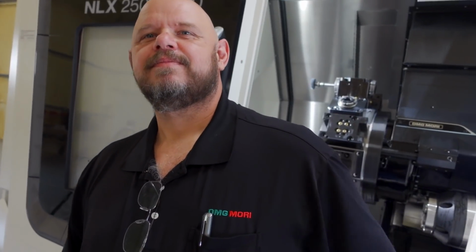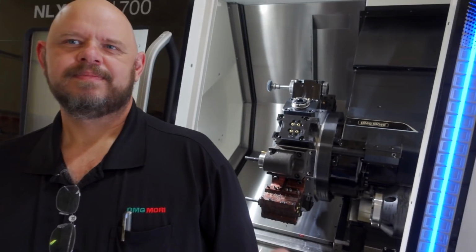So you were telling me that you run like this. What is this axis wise? How many axes? What is this considered? So this particular machine is what we call a 4-axis lathe. It's got X, Y, and Z plus the C axis for the rotary. I specialize in machines that go all the way up to 9 axis, multi-turrets, milling, all the accessories, bells and whistles. So whenever I get a 5-axis mill, that's actually a different beast than what I work on.